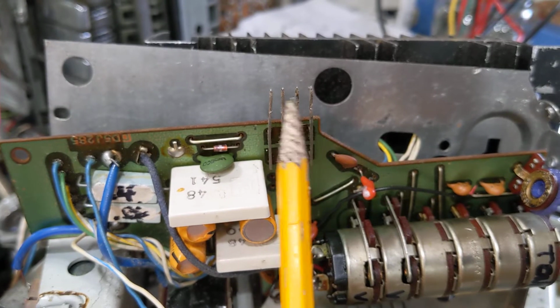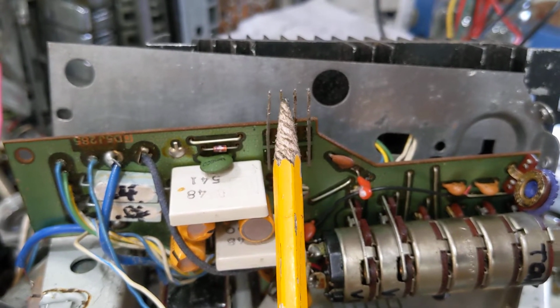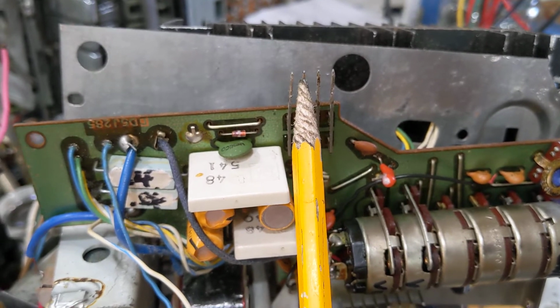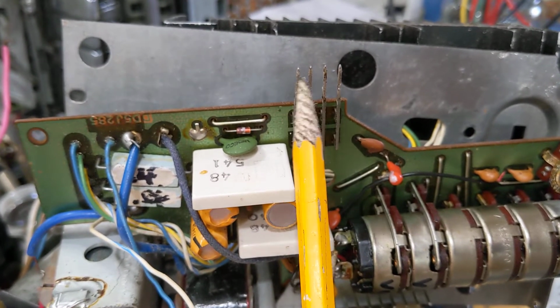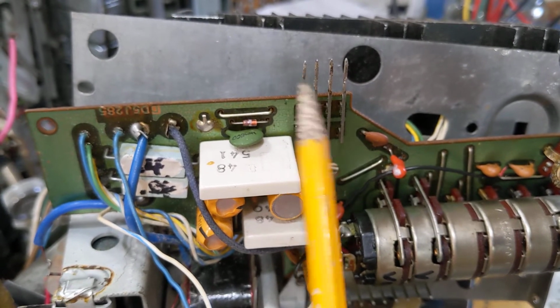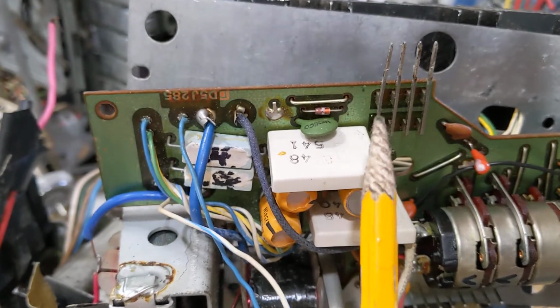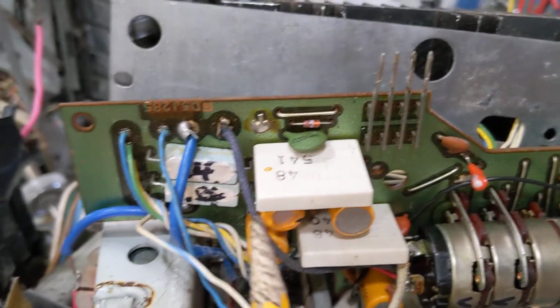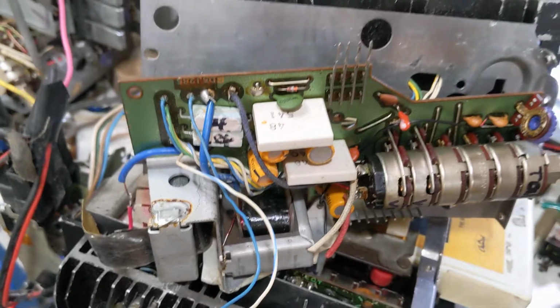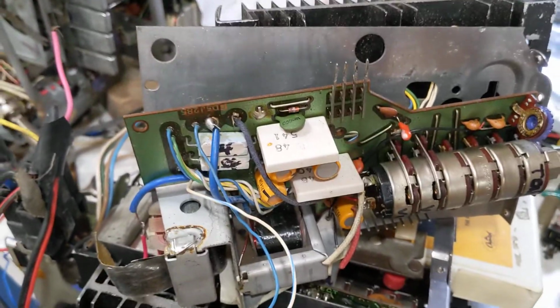And sure enough, I opened up a couple of the, what do you call them, the traces, signal traces. And so then, once I figured out that the signals weren't passing through the signal traces on the board where this inserts and gets started, I was able to patch it up, and the radio is working well now. And I'm gonna button it all up and get it all working again.